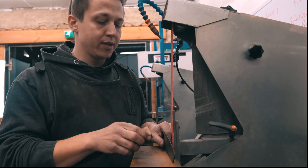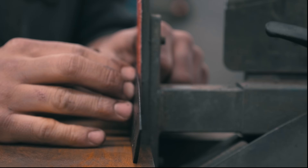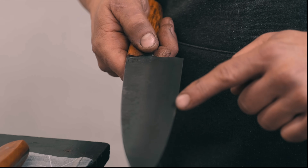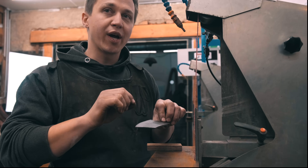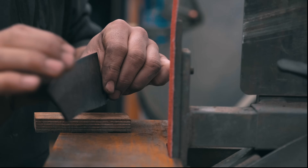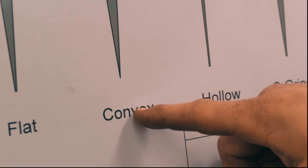Now you can already see I stand much more comfortably. I stand further away from the grinder, I have the work rest which takes away the downward force, and I can actually apply a fair amount of pressure. This technique still needs a lot of practice because you have no guidance of the angles. It will still be very difficult to get the same angles every time and to get even grind lines — especially if you have a forged finish that you never want to grind into while going through five different belts. It's going to be tricky. But still, this is a huge upgrade and it's still very versatile. You can start making convex grinds on this if you're good.